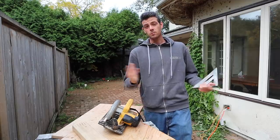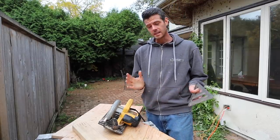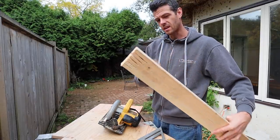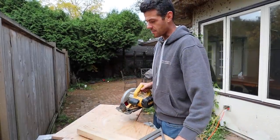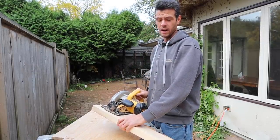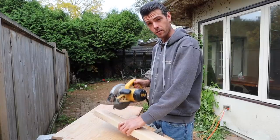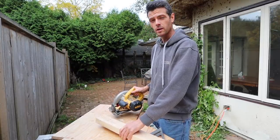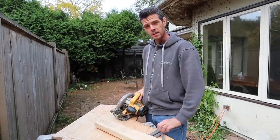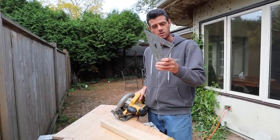Let's start with the really square cuts because this is a real easy one. I've got this piece of 2x4 here that I cut a bunch of shims out of and I'd like to put a cut on this. If you're experienced you can pretty easily make a reasonably square cut just by eyeing up your fence. However if you're new or you want a really square cut, there's an easy trick you can do with your speed square.